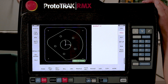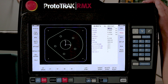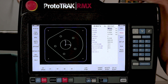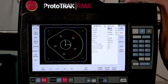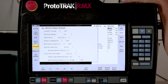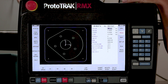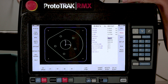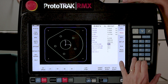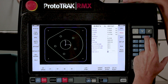Now I'm going to make some changes. I'm going to go back to program mode and swipe back to the beginning of this pocket. In the options page, I want to point out that all the stuff you've been seeing in the defaults - the tool path, how it enters the material, clockwise or counterclockwise - those are all things I set up for how I machine most of the time. For this event, I want to change some of my normal defaults. In the options page, I'm going to change from zigzag to helico, and from parallel to adaptive machining. I know I can do this to full depth now - I can boost up my RPM to 5,000 for both rough and finish, helico in at 40 inches a minute, run at 60 inches a minute, and finish at 50 inches a minute using the same tools.